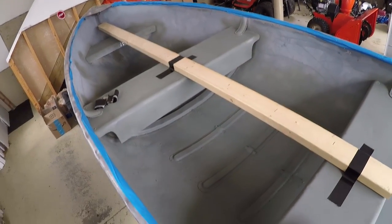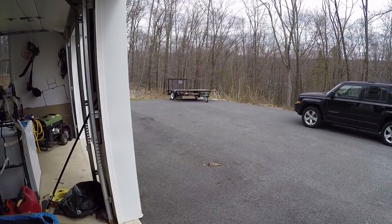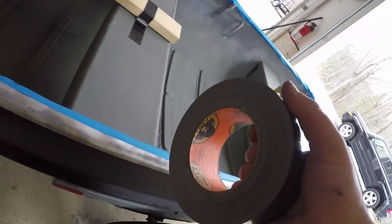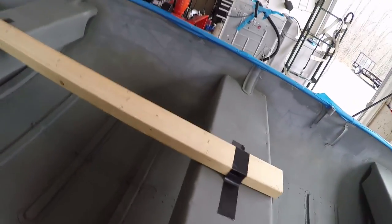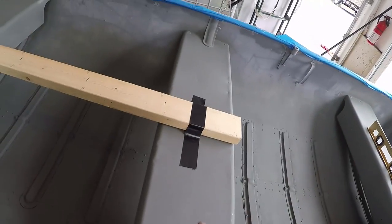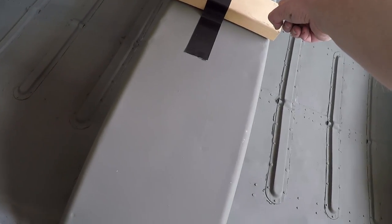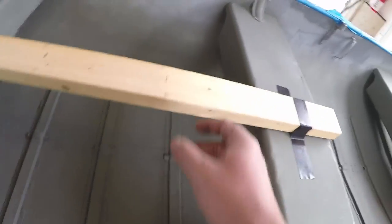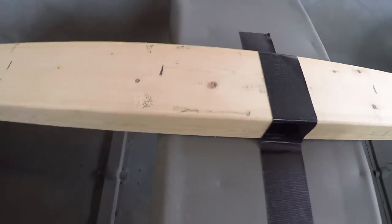I'm building the deck and getting measurements. I've got a piece of plywood on that trailer and I'm going to transfer the measurements. The first time I did it everything came out really screwed up. So what I did now — because I don't know if the board's flush, it's crooked and angled — I taped the board down, took the measuring tape, put it on the end of the board. It's 25 inches from here to here, and every 10 inches I did the same thing — 23 and a half — all the way up the board.